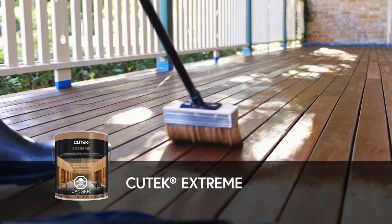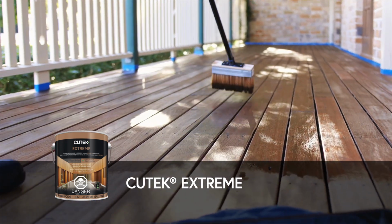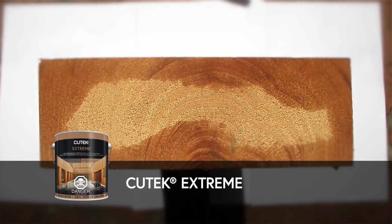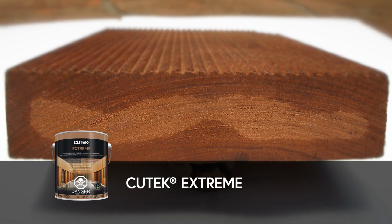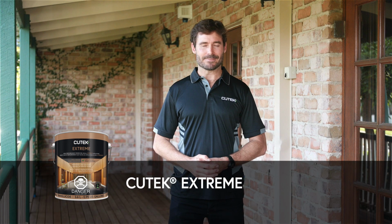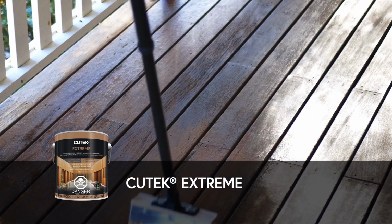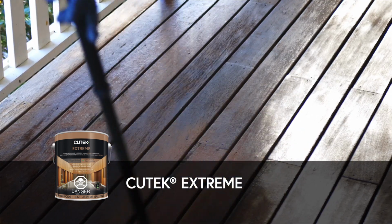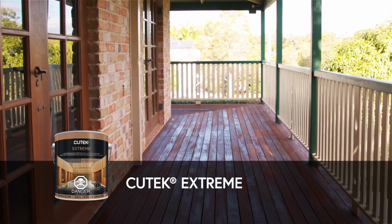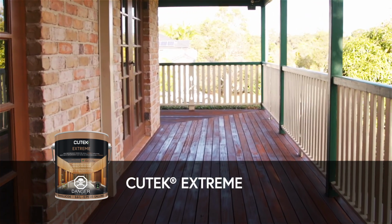After coating, CUTEK Extreme CD50 will slowly migrate into your wood. This diffusion process can take several days to complete. You will know when your timber is ready for a second coat when it is completely dry and non-greasy. The second coat of CUTEK Extreme CD50 will take longer to migrate into your timber than the first. After the final coat, make sure you keep off the wood completely until it is completely dry.